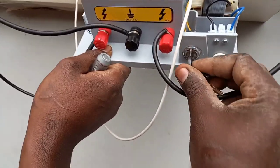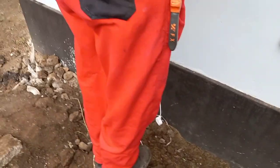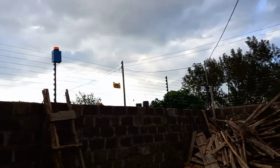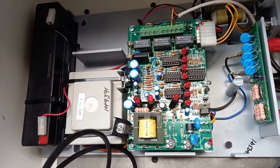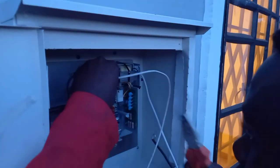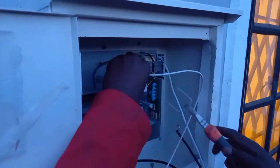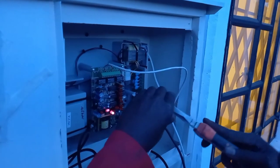When one wire is disconnected, the alarm will go on. If there is a short circuit between the earth and the live, the alarm will go on and alert you. If someone tries to jump over, the alarm will alert you. So as you can see, we are finished connecting and now we are going to test it. If you hear this sound, just know that it is working. Now we short circuit to see if it's working — that means the power is going to the fence.